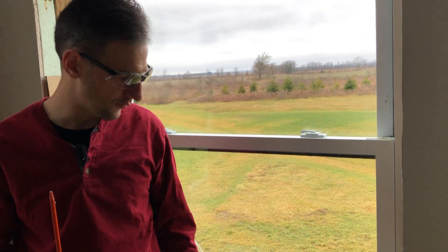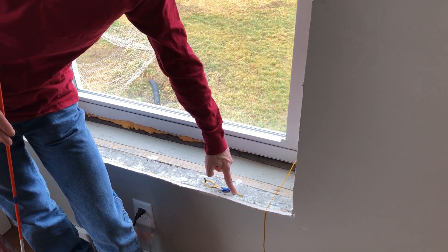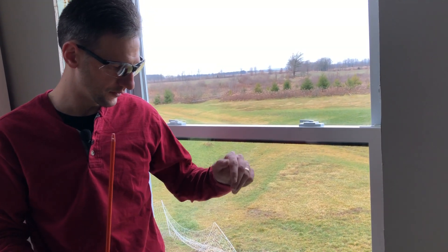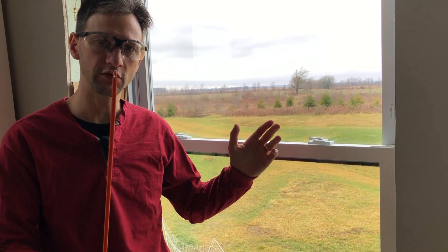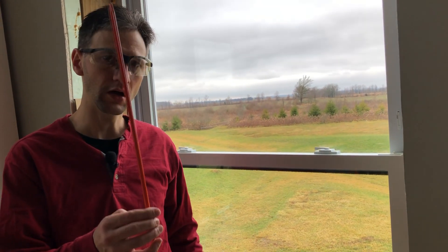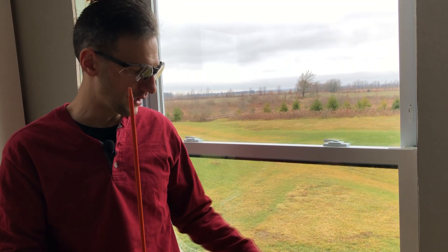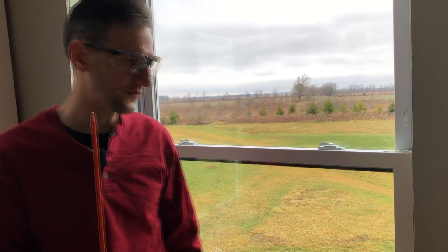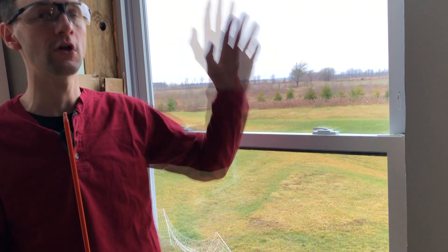So that's across. You can see here I've already drilled one down to go into the basement. I'll show another one here in a minute where I'll drill a hole through the floor joist with our two-inch auger bit, and then I will drill from above with this rod to connect the two holes. That will allow us to drop these lines into the basement so that we don't have to have any unsightly plugs on the surface of the wall for our blinds installation. So let's go ahead and do that.